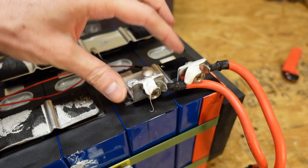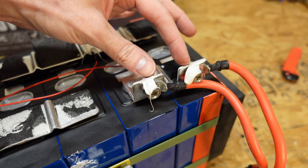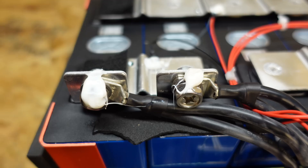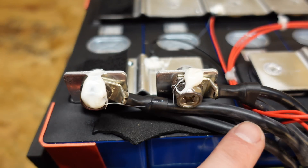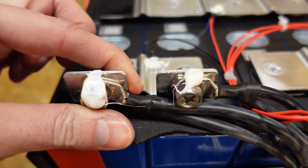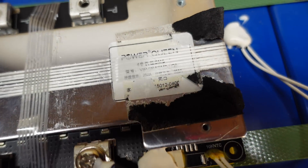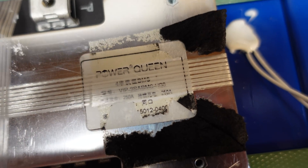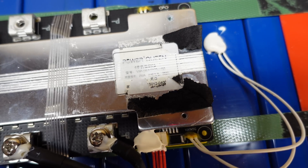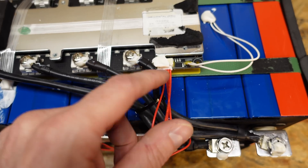There is one piece of aluminum going directly across the two posts, then it splits into two L-shaped brackets, with one positive conductor connected to each. The negative is done the same way — two of the eight gauge wires go to one ring terminal and two to the other. All screws are nice and tight, covered with white silicone. Looking at the BMS, it says Power Queen but appears to be a VIP brand based on the model number — we've seen these VIP BMS units in a number of other batteries.